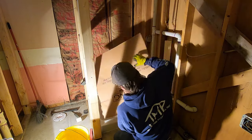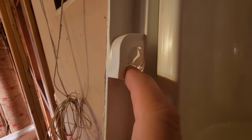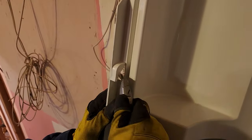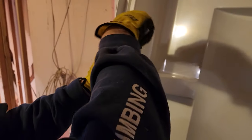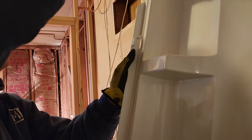Once you get the base set, let's put a piece of cardboard over the top of the shower unit. Here's the fun part — these are the shower walls. What makes these Sterlings unique is you install the walls and they snap together. There are no bolts. You can do all the work from the front or inside the shower unit. Sometimes you've got to take your razor knife and trim where the hooks go together — that's what Mike's doing right here.